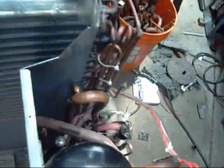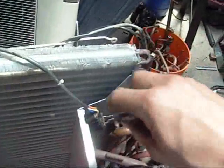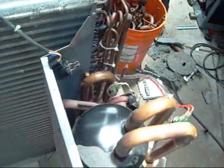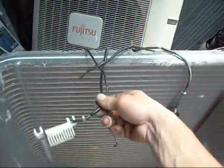That's the electronic expansion valve down there — should just be able to pop that head off. It's just a stepping motor and it winds the needle down inside the socket inside that canister, just like a fuel needle on a carburetor. I've done a cutaway video on these before, so look up 'electronic expansion valve exposed' and you'll find my video on how they work.